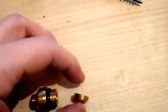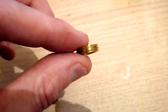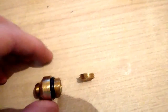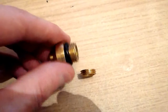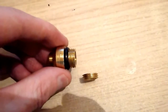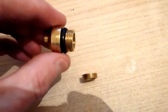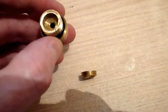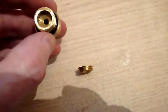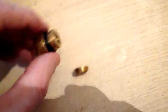So that's what I've taken off — there's about three threads there, but there were four when I started. It's just that you've got the thickness of the hacksaw blade to take into consideration. So you've got to leave a few threads on there just to make sure it's going to tighten down properly without busting, because it is only brass. I've filed it down a bit, smoothed it off, and I'll rinse it with a bit of oil just to make sure it's clean with no bits of filing in there.